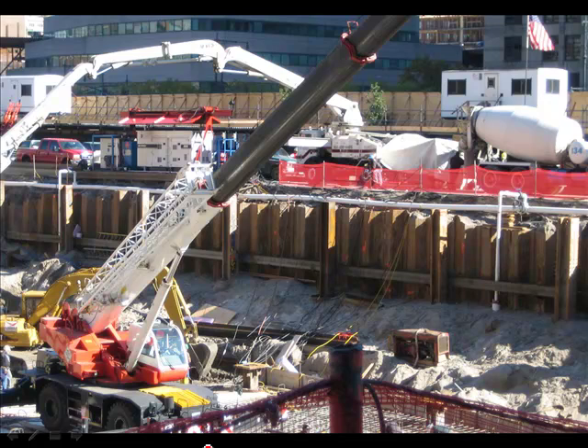Very often that's a simple procedure — you might just slope the bottom of your trench and have it all collect at a low point. You might excavate a small local sump to catch the water and assist you in pumping it out from time to time. But here in a major excavation which is taking place below the water table, you need to dewater the site on a continuous basis, and the water is pumped out of this site 24-7.